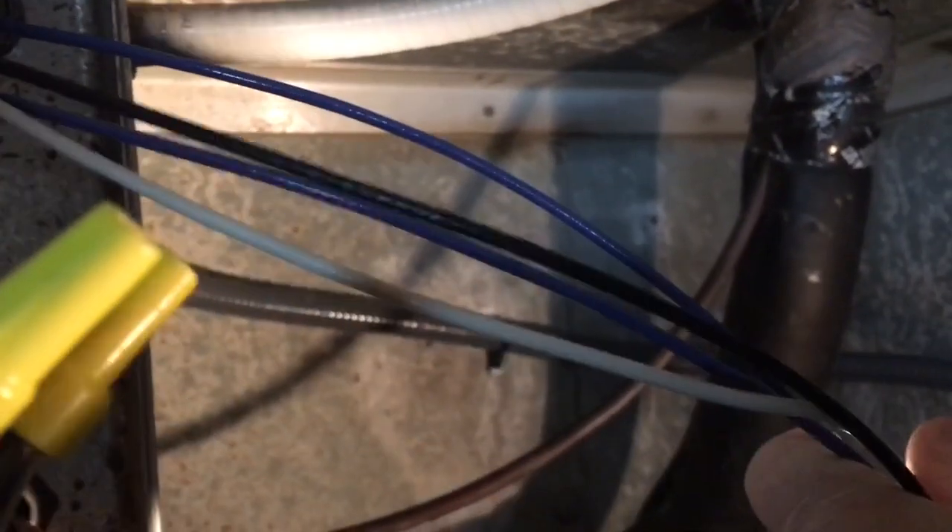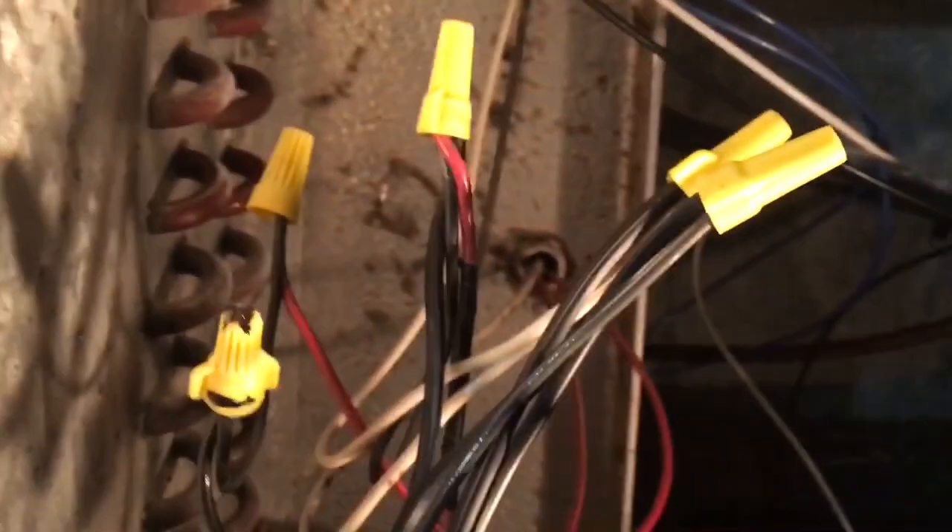My black and white is my neutral — it's 115 volt. Black is my hot, white is my neutral. And then my blue is my set of contacts for the coil. I've got it jumped out right now, nothing's running, so I can work on it.